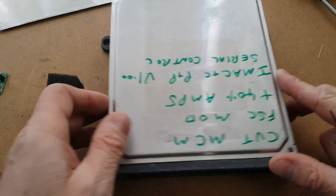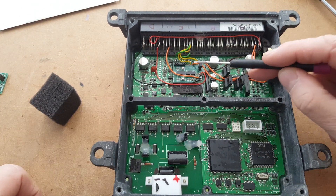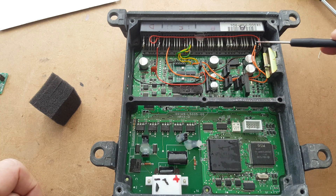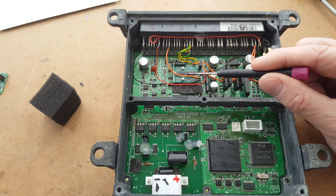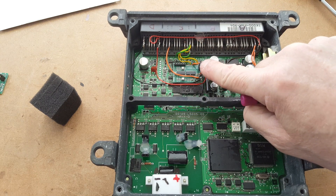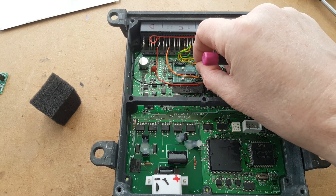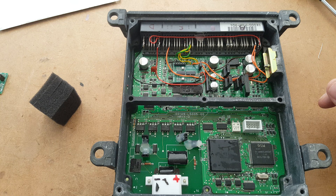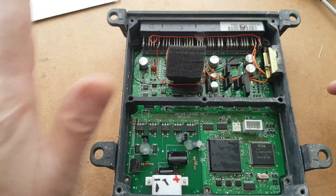So that's it. I'll flip it back over so we can see the circuit board in position with all the wires connected — ignore the red wire across the top, that's a different modification. If you need to reprogram this for any reason — sometimes I'll update the firmware and post about it on the forum — what you need to do is take off this little jumper here. If you don't remove the jumper when you plug a programmer onto these pins, it will try to power the whole thing, which it can't do. Removing the jumper disconnects the 5V. Then put your programmer onto these pins and update the firmware with the PIC programmer. Afterwards, don't forget to put the jumper back on, then put your foam in and put the lid back on.